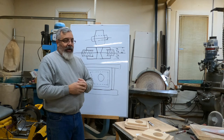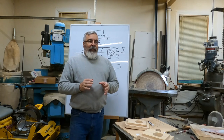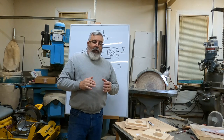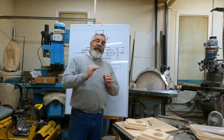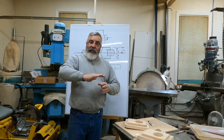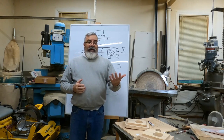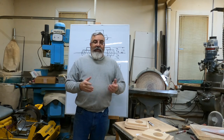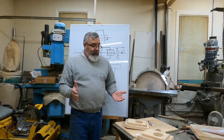And it's pine. Yeah, I really would like to, especially the core box sides, usually do them out of mahogany. Foundries in the core rooms, when they make the cores, they usually have steel bars or whatever, they strike off the tops of the core to make it flat, so that wears, all right? And a piece of pine is not going to last. It'll last 100 cores, maybe 200 cores, something like that, but we're only doing 2, so we're going to do it out of pine, out of the same piece that we used, all right? That way, it's already the same thickness.